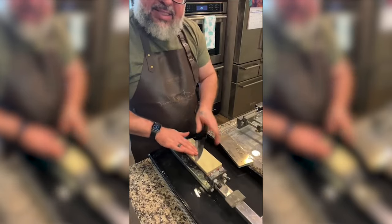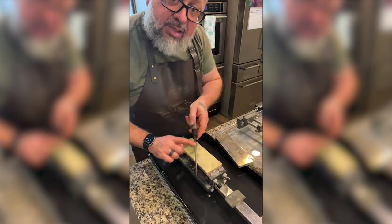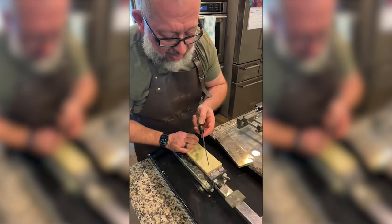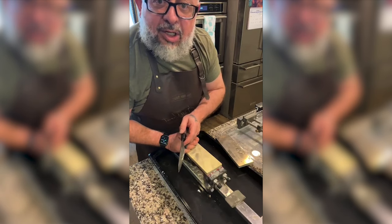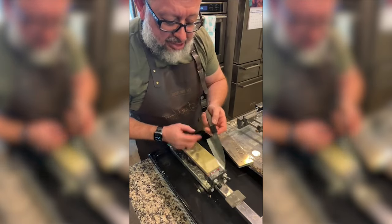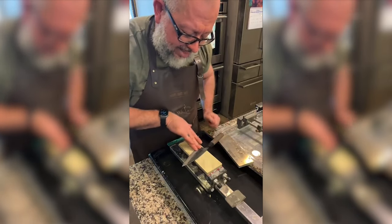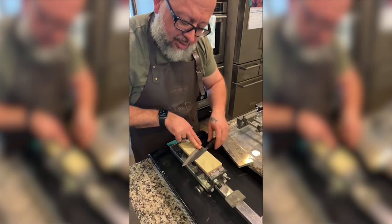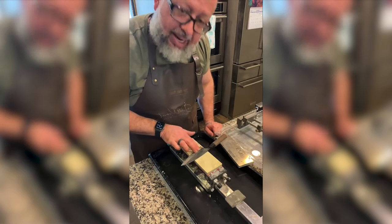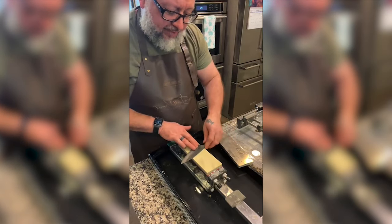I learned from Milan today something that I never thought about, which was that a lot of the knives with the thicker spine, the Shinogi line, thanks. He says, Dre said, I have to mess up to learn, and I agree. I've always learned more from making mistakes. But what I learned was the Shinogi line, I never really thought about it. The Shinogi line is deeper. It's a bigger angle when you have a thicker spine. And so when I'm at the back, the angle there is going to be steeper than down here. And so keeping my fingers where they need to be is very important as I progress up the knife, because the knife is actually slightly changing its angle. So it was very interesting to see that.